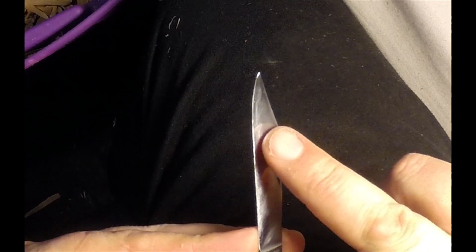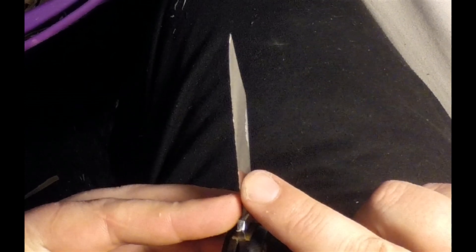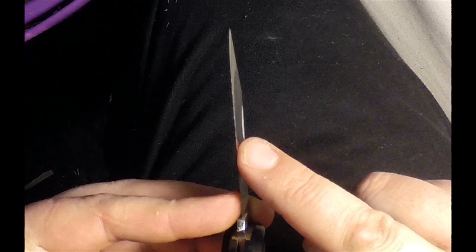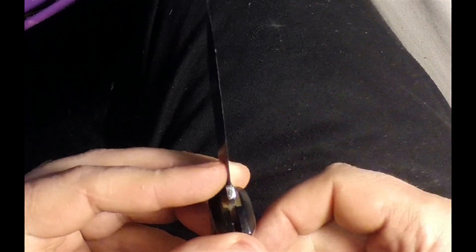You want to throw a few hundred cuts into it because it takes some time to get all the random effects. Unfortunately there is some edge damage. The edge has rippled and been pushed to the side to a maximum thickness of around five thousandths of an inch. So the angle is too low — it doesn't have the necessary strength to keep the edge bevel in line.